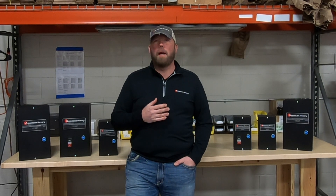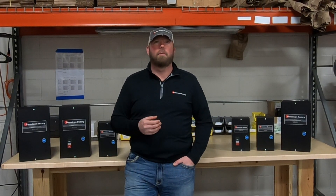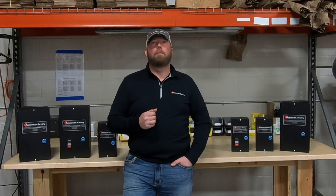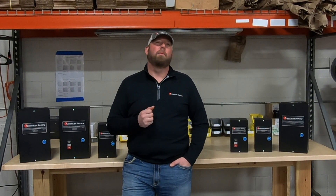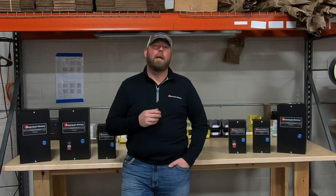Many times when you buy a piece of equipment, it doesn't have a standard motor starter that comes with it built in. Adding in a motor starter will help protect the motor and the equipment from the high amount of current passing through the motor when the power is turned on.